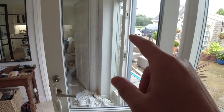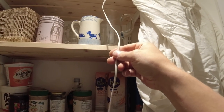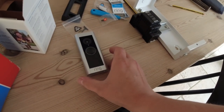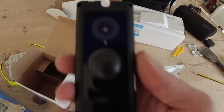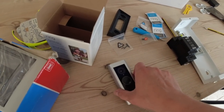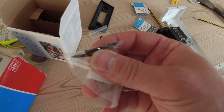We're now at the stage where the cable is run from point A to point B — this is our two-core bell cable. To fit the doorbell, you remove the cover and you've got two fixings, one at the top and one at the bottom. Once it's fixed to the wall, there are two terminals on the back, and they give you a nice little screwdriver and the right size screws and wall plugs.